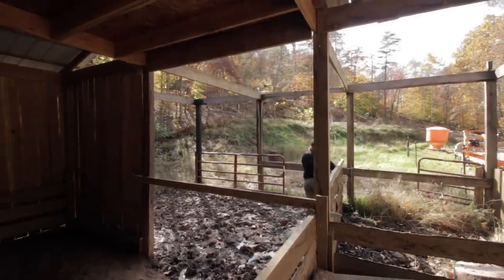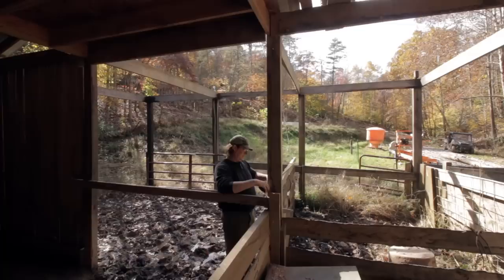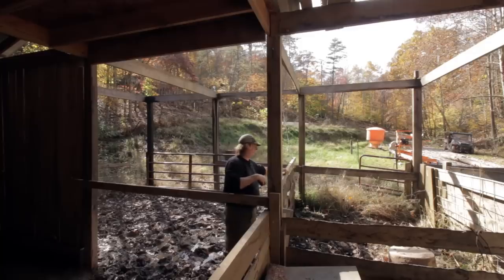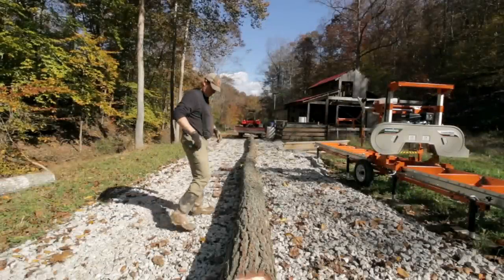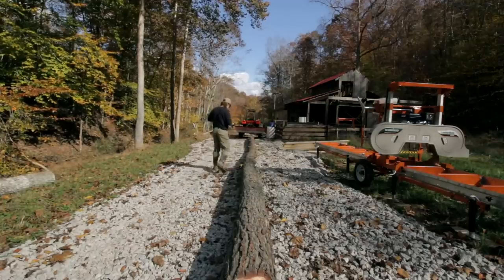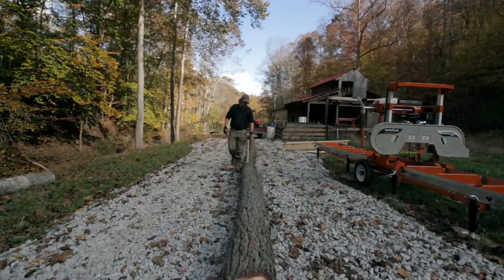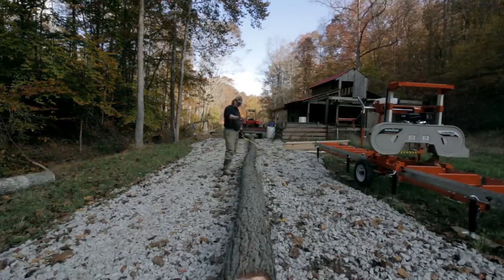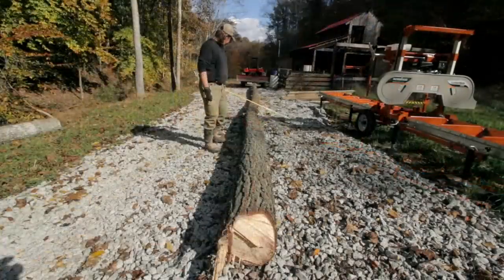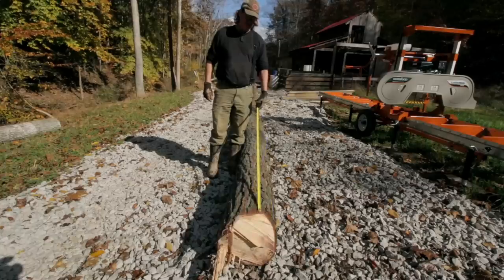Twelve feet — somebody was very daring. So if I do on 16s, on 24s I'd normally need six boards plus my ends, so that would be eight boards. As you can see, there's a bit of a bend in this log where it grew, and it really manifests itself about right here where this green leaf is. If I incorporate that bend in the log, I'm obviously milling parallel out of that and I'm going to lose a lot of material. To get my eight feet out of this, I also don't want to start at the very end of the log because there's a big notch taken out that's going to affect my material.